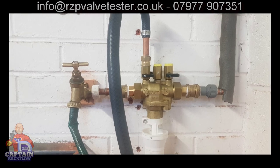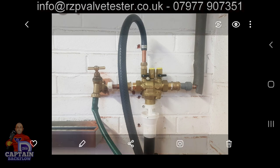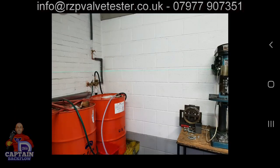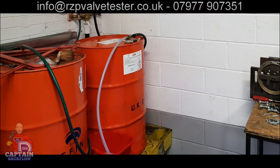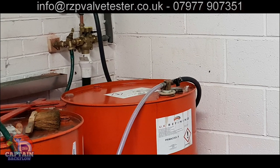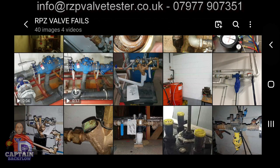This is another valve installed by others — I get asked to go and test it. I turn up and there's a hose coming off test port three with a bib tap after it. There is a number one isolation valve but no strainer, and this ECO 3T valve needs a strainer. Off test port three, they're feeding a coolant mixer — that hose drops basically straight into a tray, which is fluid category 5. The application is category 4, but where they leave the hose dangling is a five. The bib tap feeds a floor scrubbing machine, which is also fluid category 5.